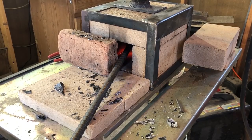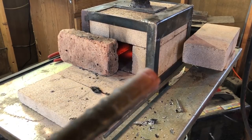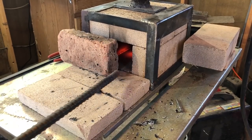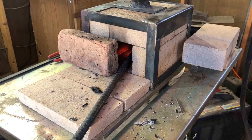One of the first builds I ever did is pretty similar to this one, so I will leave a link to that video. The idea is I'm going to start with a piece of scrap that pretty much anybody has access to — this is a piece of 5/8" rebar. You could use something a little narrower or wider. I'm starting with 5/8" because it's what I have, and I know I can concentrate the steel into one end to give me enough to work with to make a pretty decent size tomahawk or hatchet blade.